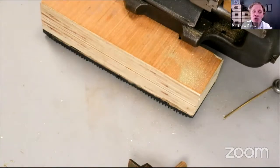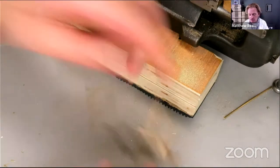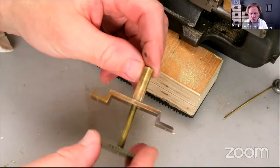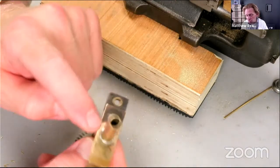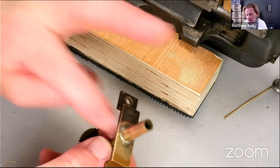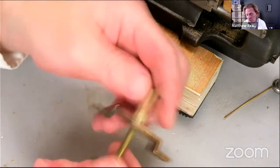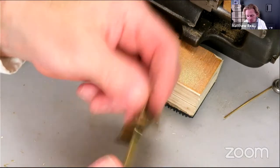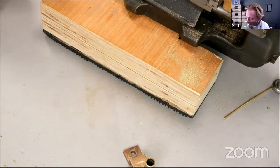Anyway, thank you for watching. It's been a bit of a saga tonight, but we had success with the soldering. That was a major repair on the route to getting this clock back on the road again. So we're happy with that. You saw we put solder on the back. It just ran through those grooves that I filed around the front between the 2 components, made a nice fillet, and you can see all the holding we've been doing. So it's nice and strong. Just need to broach out that bush, the reinforcing piece on the inside, and I'll keep at that now until it's done.